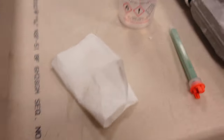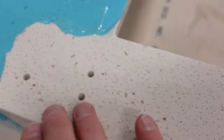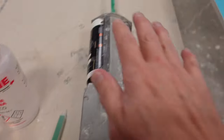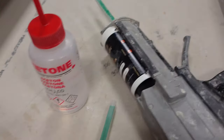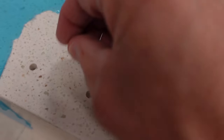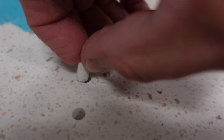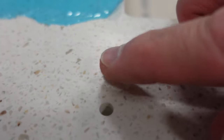I've got a paper towel here with some acetone and we're going to clean the surface. Then I'm just going to use some two-part epoxy — this is Glacier White adhesive. We're going to put that adhesive right on these holes, then take the little plug and put it in the hole and twist it as we go down to make sure it's covered with adhesive. After it cures it'll be sticking up a little bit — we'll grind that down flat.